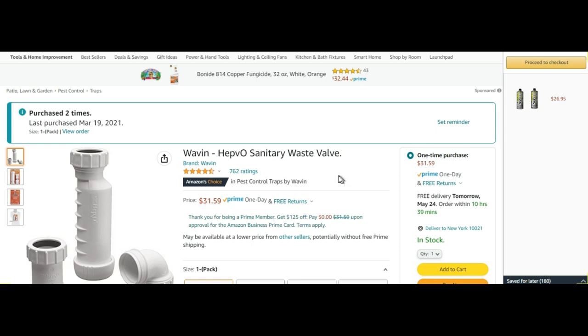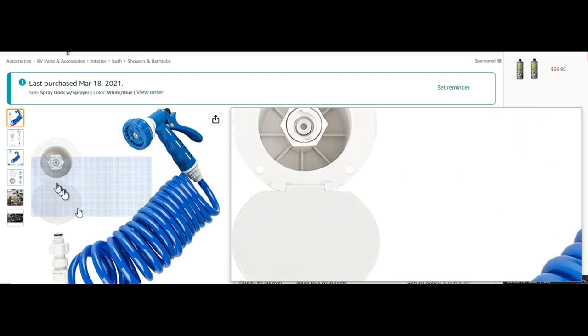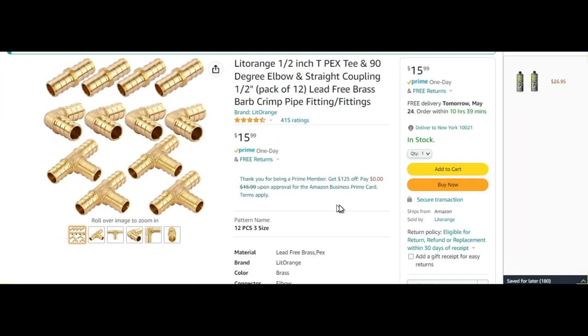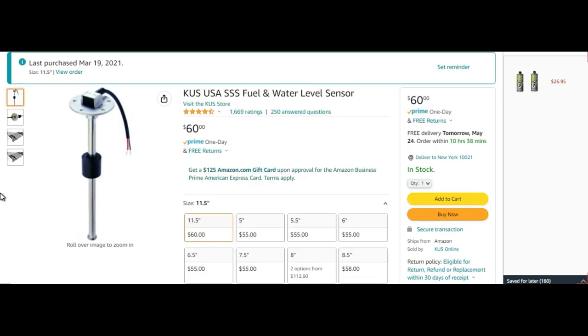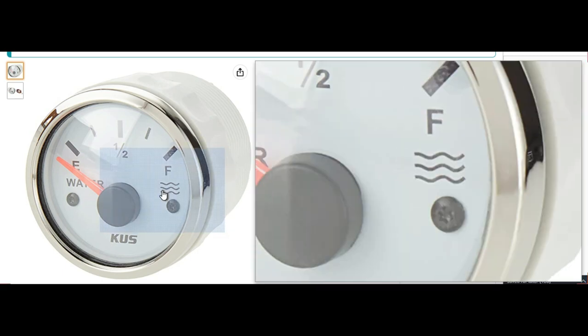This is my faucet and kitchen galley — I'll have a video linked about the kitchen galley and how I made it for cheap. These are the valves that prevent water from flowing the wrong way and keep odors down. If you're worried about odors in the kitchen area you really don't have to be — you can just make a loop like I showed you. This is the connection for my outdoor shower and also for my interior shower. These are the 90s for the PEX — comes with a nice assortment of 90s and tees, very useful for making connections to a drain.